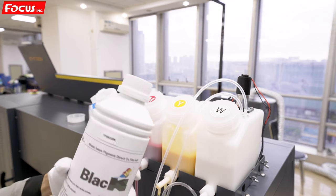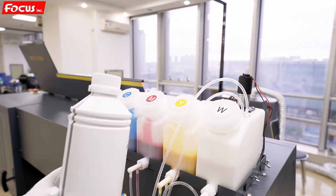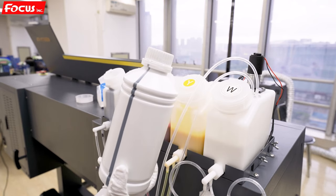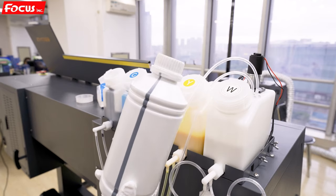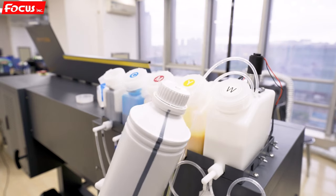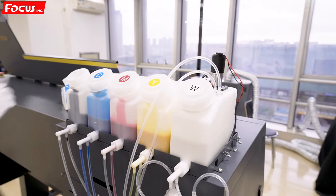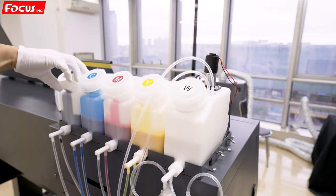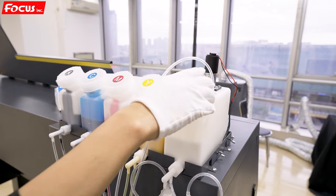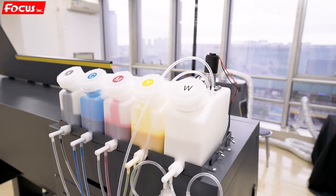Please pay attention that the balance of ink staying inside the bottle must be kept without any sunshine and at the correct temperature, between 21 to 28 degrees, without hot air, dust, or strong sunshine, and kept well for refill. Let me install back the cover. Loosen the cover a little bit. Okay, so this is the procedure to load ink to the big ink tank.